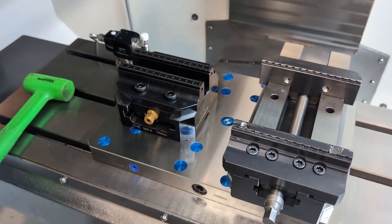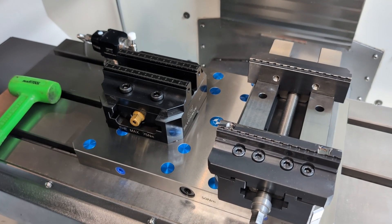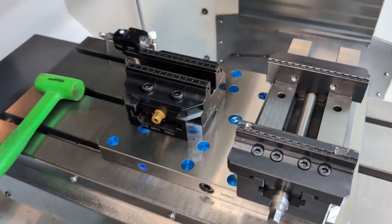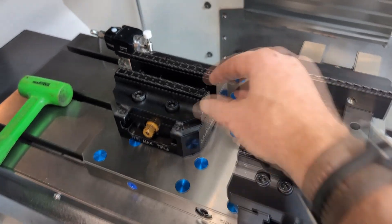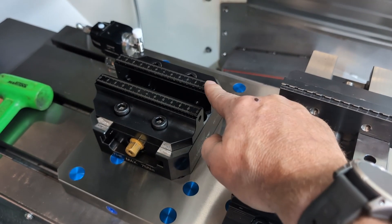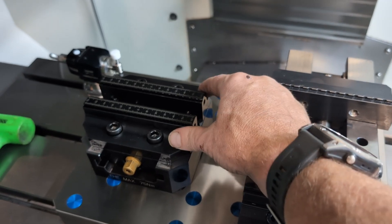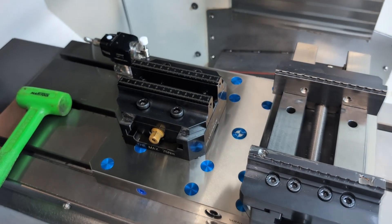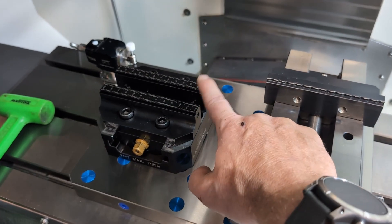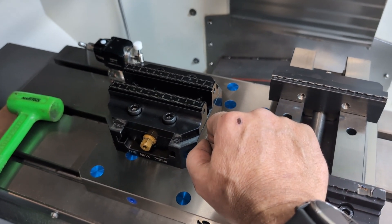I ran about a week's worth of parts — I do a lot of engraving, little special engraving stuff — and I was getting really terrible surface finishes. What I've learned is I get about five thou lift on this and three thou lift on this when I clamp it up. That is repeatable, but how it clamps in here isn't repeatable. I'm not confident doing second ops on this; it's good for first ops, it's aggressive, it's good for what it is.